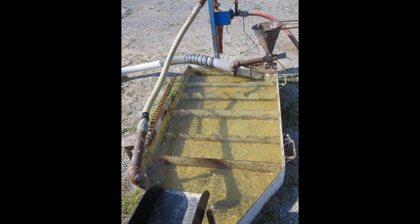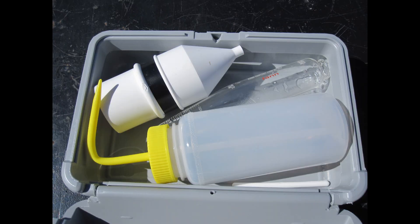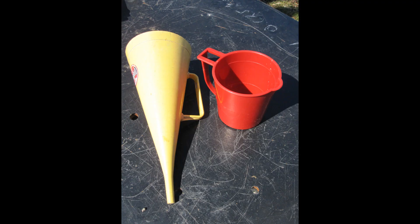When taking samples, take at the middle depth at the suction end. The mud balance measures density in pounds per gallon. Water is 8.34 pounds per gallon, and our readings should be between 8.34 and 9 pounds per gallon. The sand content should be less than 2%. The pH should be between 8.5 and 9.5. The hardness should be less than 100, and the viscosity should be between 32 to 38 seconds per quart, or higher when necessary. Water is 26 seconds per quart.